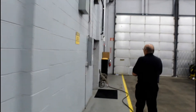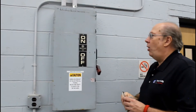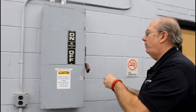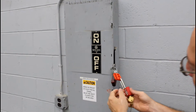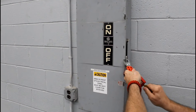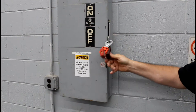In this case, our main power for this machine is here on this wall. We're going to shut it off. We're going to use our hasp and our lockout. Put our hasp in, our lock with our name on it so whoever comes by will know. We're now going to make sure that it's locked out — it is locked out and it won't turn back on.